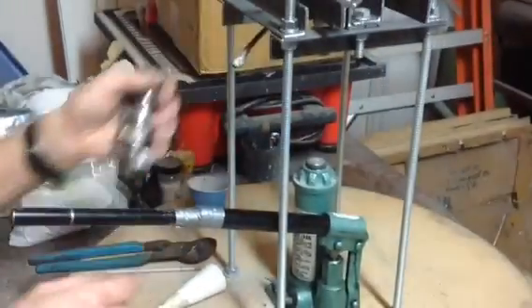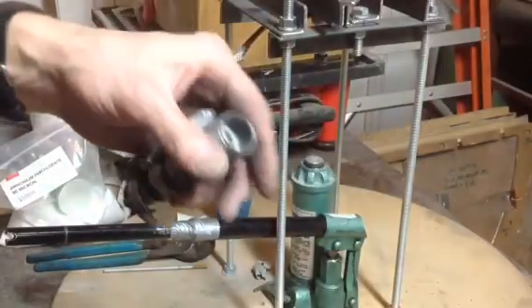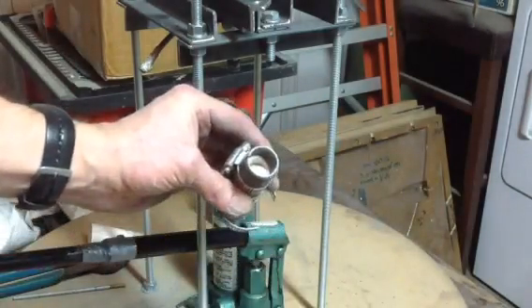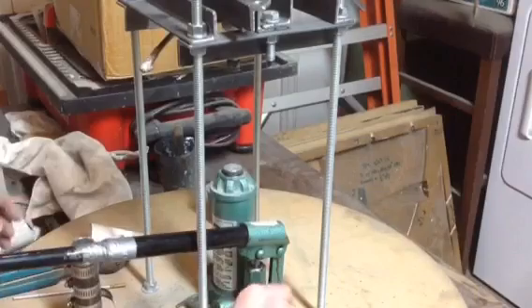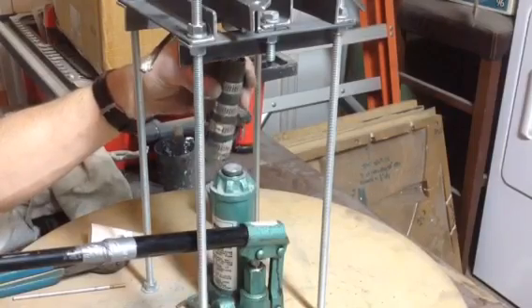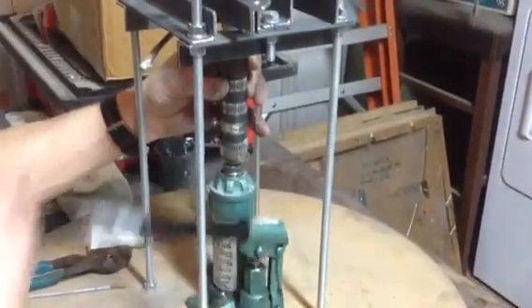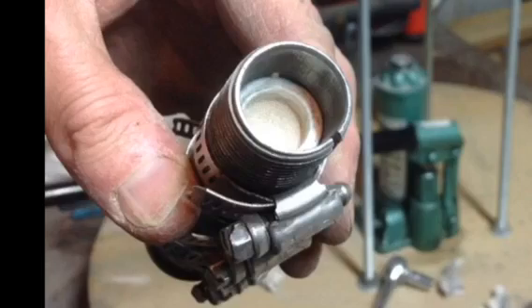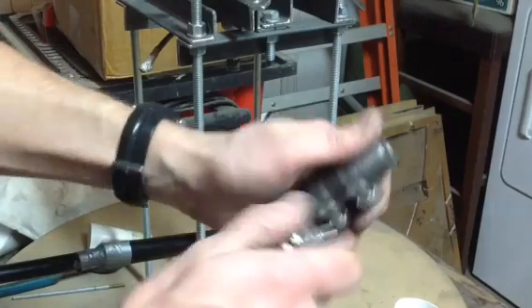In the background to the left you may see a bag of ammonium perchlorate now and then - that has nothing to do with this video. These mixtures are purely potassium nitrate oxidizer. After the last of the propellant is added, you see the hard top of the grain after cleaning out a little bit of loose powder. Now I'm going to use a total of six grams more of the fire clay mix. It also has grog, so it has some bite and bites into the PVC pipe. Because this is a plug motor, there's no ejection charge. You'll add the six grams of fire clay mixture in about two or three portions. I'm going near the limit of this press - not the press itself; the press seems to be stronger than the hydraulic ram, but it's only a two-ton ram. And that's after six grams of clay has been added.